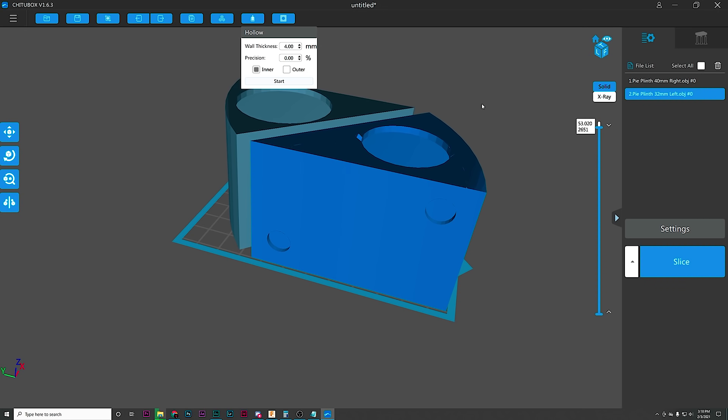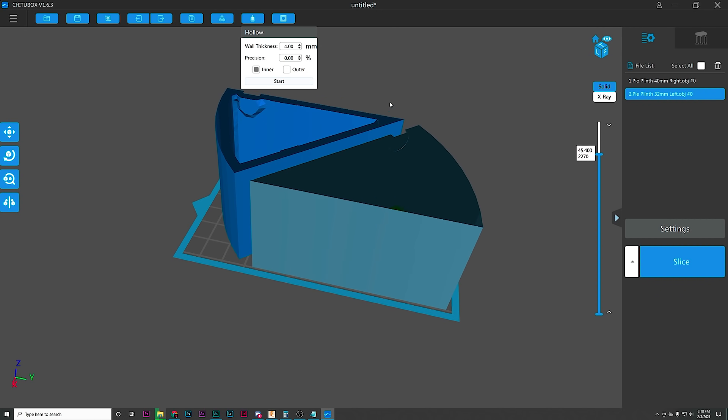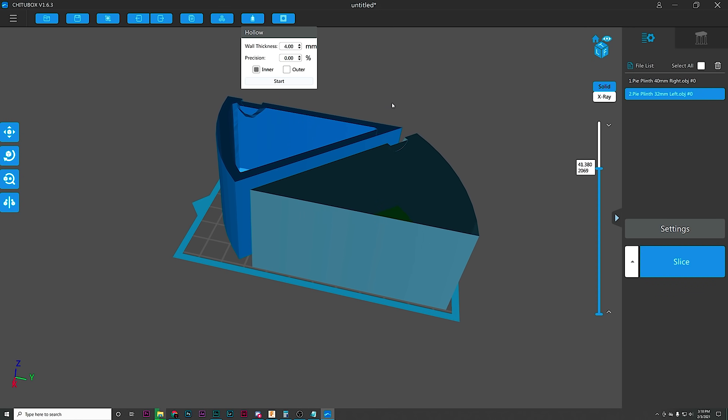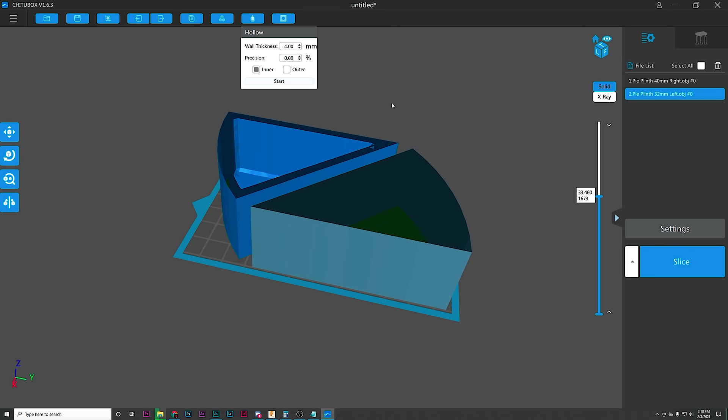I didn't do it on this, but I should have raised the design up a little bit so it printed on supports. I think if you print the thing right on the build plate, it'll develop a little bit of a resin foot, but I think I should be able to sand it away just fine. I have a light on top of my camera rig right now just to give my face a little bit more fill. It's pointed straight at the ceiling, but it also has some fun modes such as police mode, paparazzi mode. Alright, enough mucking around with lights.